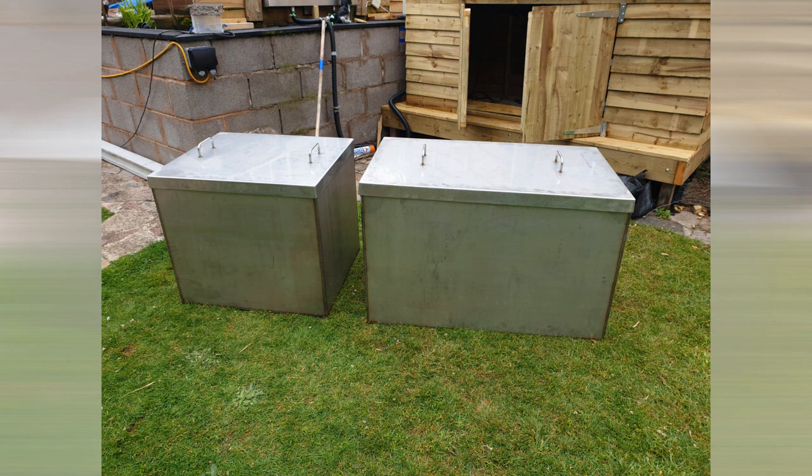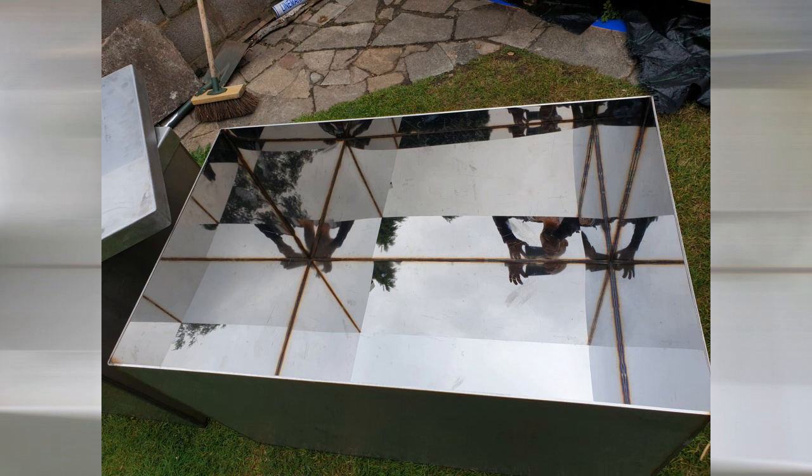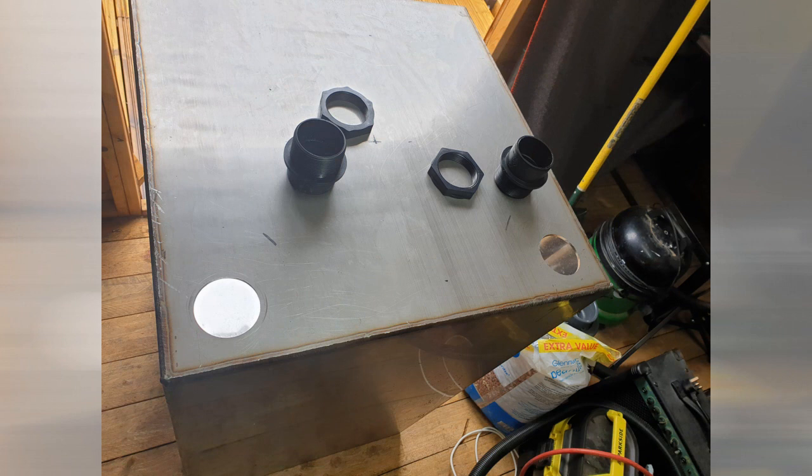That's my take on the filters and for me it works. Yes, it wasn't easy — it was a lot more difficult — but it's what I wanted to do and I'm more than happy with how they turned out. As you can see here, the internal to the filters are a mirror finish; this reduces the amount of debris that clings to the sides, making them simpler to keep clean. The drilling of holes in 4mm marine grade stainless steel is not easy — you need specialized drill hole saws. Each hole took around 30 minutes, so it made the build time a lot longer, but more than worth it in my opinion.